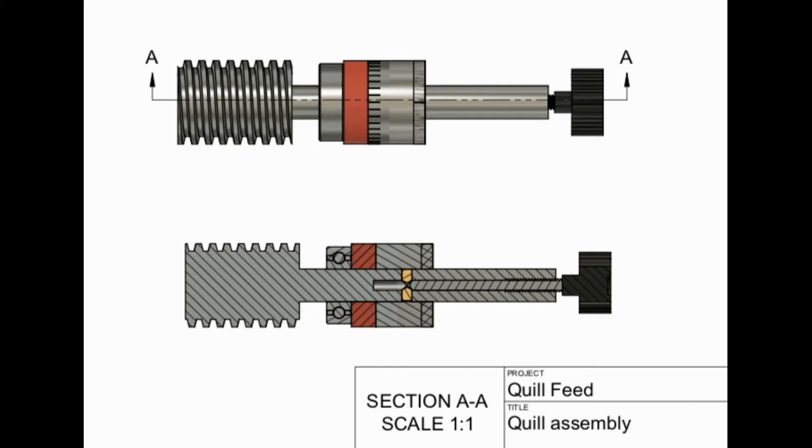So the idea is that when you tighten the knob, that push rod moves deeper into the body of the worm shaft and it forces those little brass pegs outward. They lock that graduated dial to the body of the worm shaft, and that graduated dial has the timing gear press-fit on it. So as the motor spins the timing gear, when you engage that clutch, those little brass pins are actually what provide the coupling action between the worm shaft and the graduated ring. In normal operation, the graduated ring is sort of two pieces — there's the part that spins with the numbers, and then there's the main body, and those are attached with a set screw. But of course I removed that and went with my own system, which uses this little screw-and-pin style clutch.